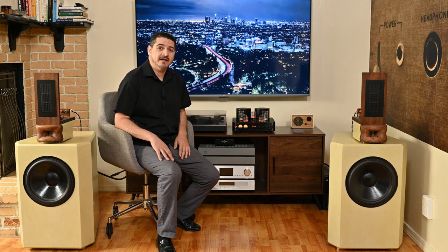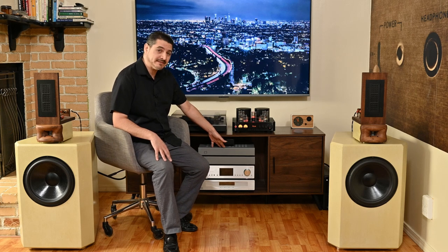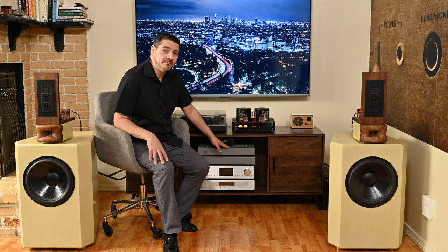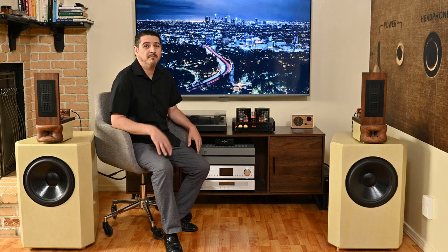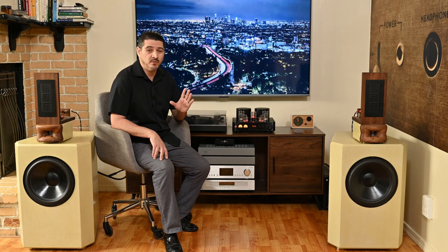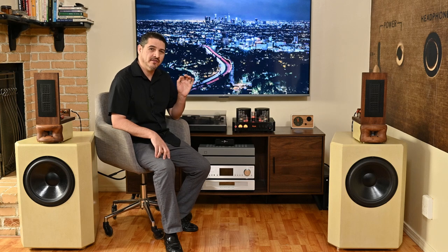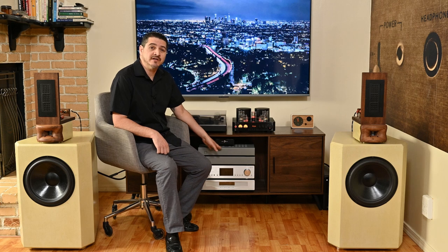I did a direct AB comparison against one of my IOTA-VX mono blocks. I usually run a pair of IOTA-VX PA-3s in mono mode, but to compare watts to watts, I disconnected one mono block and switched the PA-3 into stereo mode, putting out 50 watts per channel into 8 ohms — same as the HTA 200. My preference definitely went to the IOTA-VX: the bass was much more accurate and controlled, stopping and going exactly when you wanted. With the HTA 200, you got a little extra reverb, less bass texture, and the room loaded up a bit more — maybe better for movies, but for music I preferred the IOTA-VX, which is also a class AB amplifier.